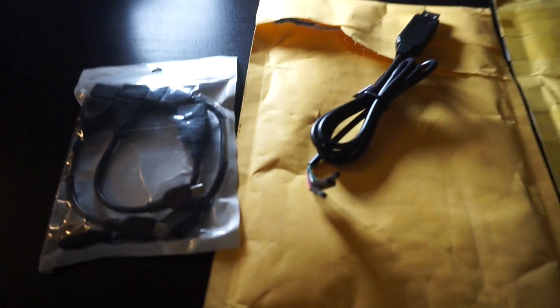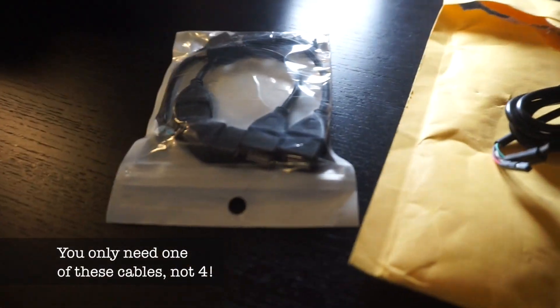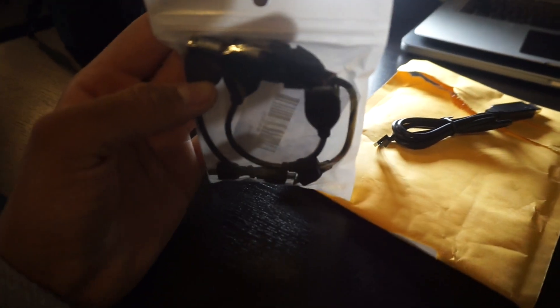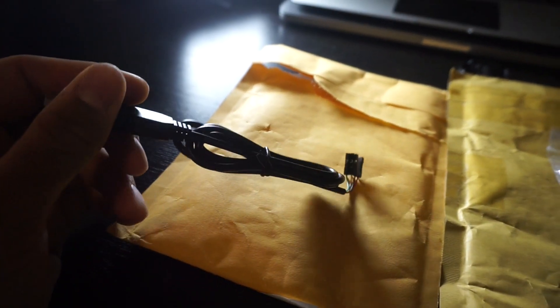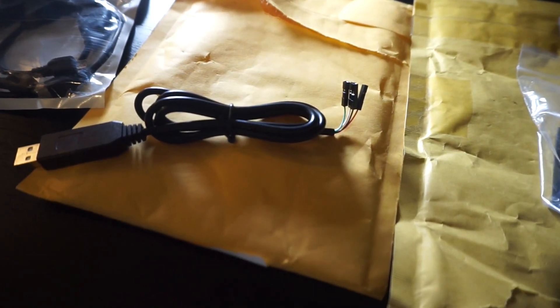Now I'm going to show you how to build a cable to use with the MEMS system. I'll go through the components you need before you build a cable, show you how to put it together, and make sure it lasts a long time. First, this is a USB OTG cable — full-size USB on one end and micro USB on the other — which allows you to have a full-size USB port on your tablet. And here we have what I believe is a USB to RS-232 cable. Links for all of this will be in the description box below.